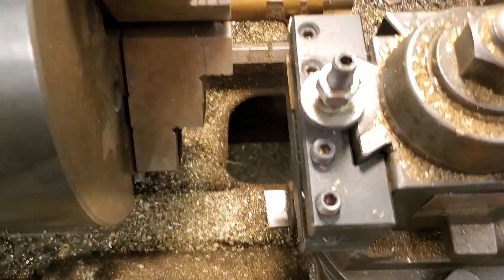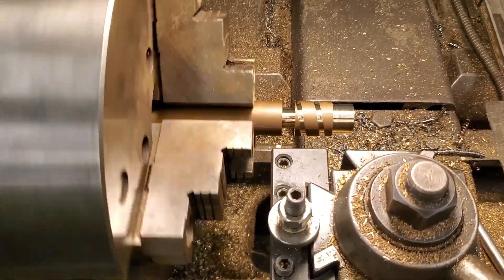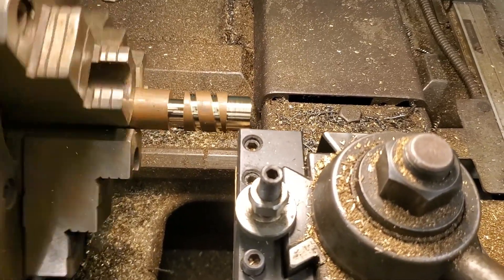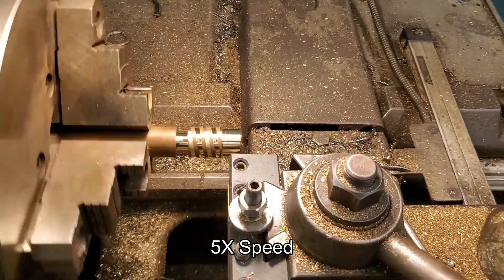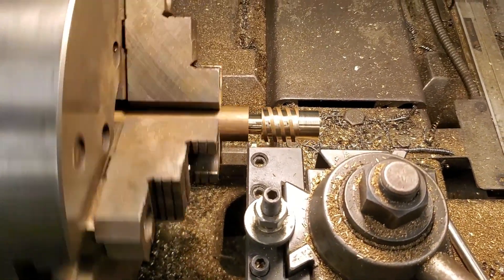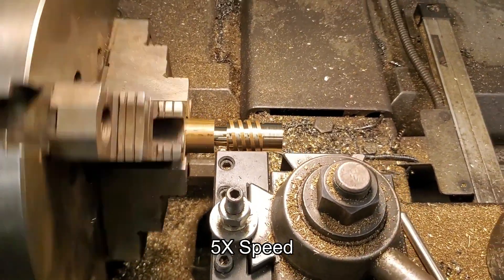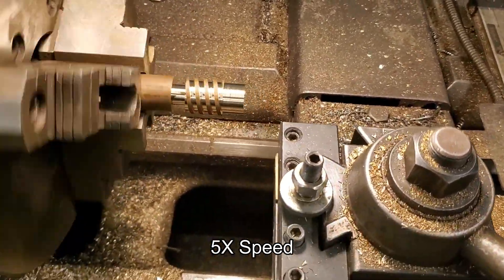The other thing I need to adjust is the feed stop on the machine. I'm making sure that my tool is well away from the part, and I'm going to turn it back on and see where it stops. You can see I've got quite a lot of adjustment to do to get it to land in that thread relief — I'll do that off camera because that's not the subject of this video. We are ready to go for the second pass, and I'll go ahead and speed this up so you don't have to watch it in real time. I roughed it all in relatively deep, and then I did two five-thousandths passes and one two-thousandths pass with a spring pass at the end just to remove any last little bit of material.